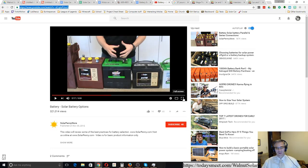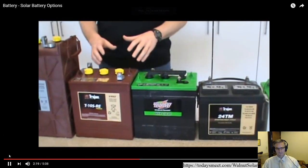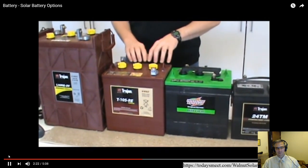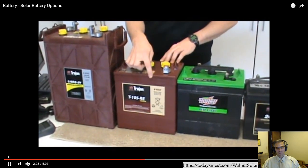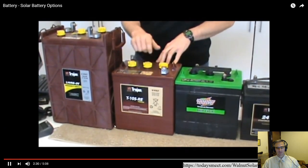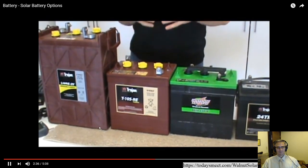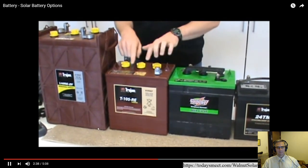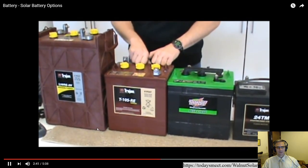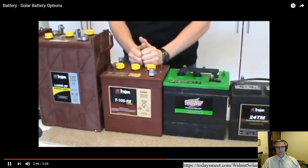Okay, we're about halfway through this video. Let's keep on going because I'm hoping, because he even said golf cart batteries weren't the best. Let's see what he keeps on saying. Quality of it. When we go to a solar battery, we're also 6 volts. There's 2 versions of this Trojan T105. There's a standard T105 and then there's a T105RE for renewable energy. The standard T105 has a 5 and 20 hour draw, so it's designed to do a shorter period of draw. The RE series has a 20 and 100 hour draw, so that $30 difference is very worth it because we can go ahead and get a higher quality battery.